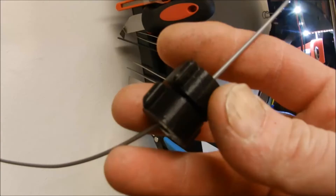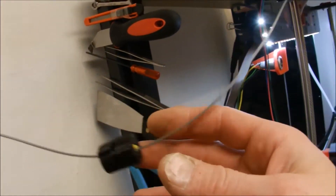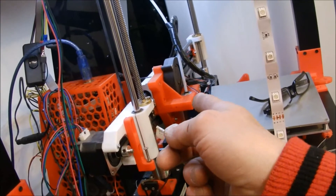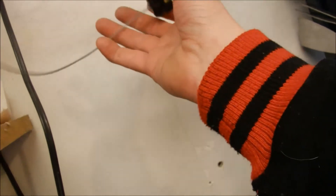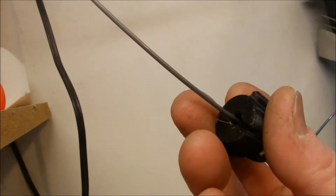For tip number four, it's a filament filter. This is mine, and what it's meant to do is collect any dust or debris that has built up on the outside of your filament. If you don't do this, it's going to get sucked into your extruder — and with a Bowden tube setup, it'll go down that tube and eventually cause a clog. Using this simple little printed filter — I'll leave the Thingiverse model in the description — it's a two-part design that threads into each other with a little cavity inside where you shove a sponge to rub against the filament and collect debris.